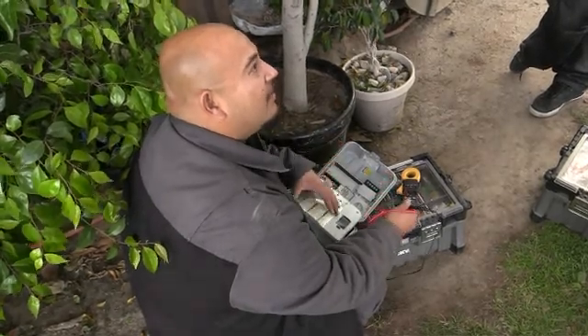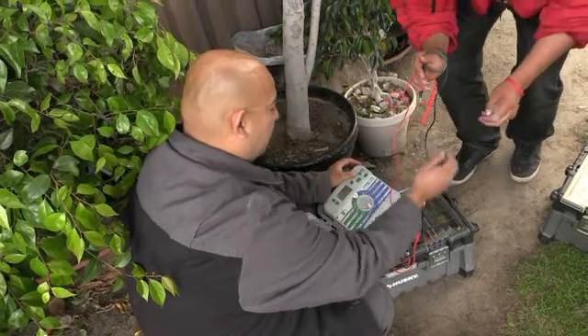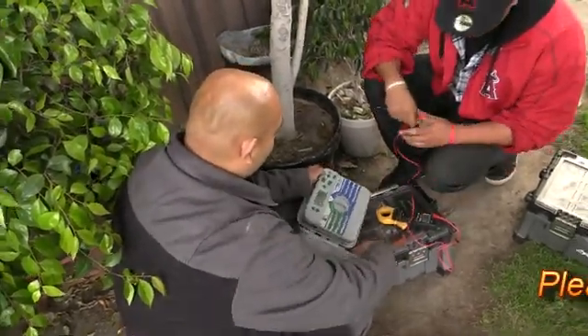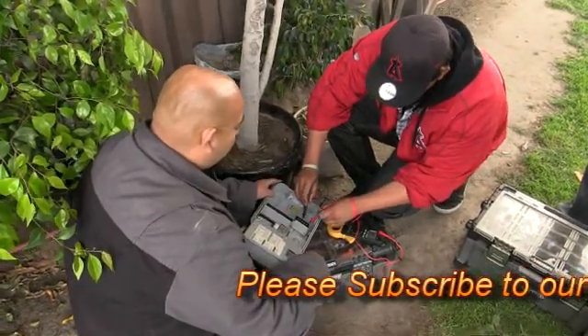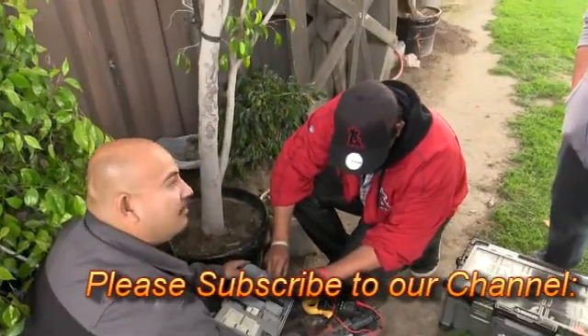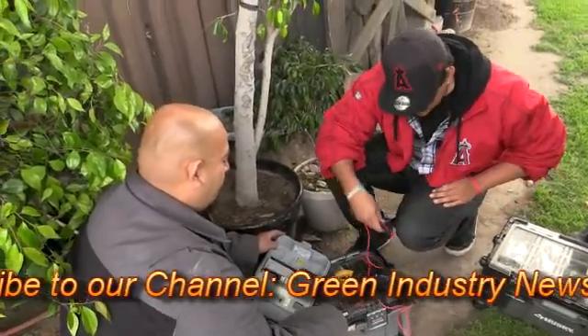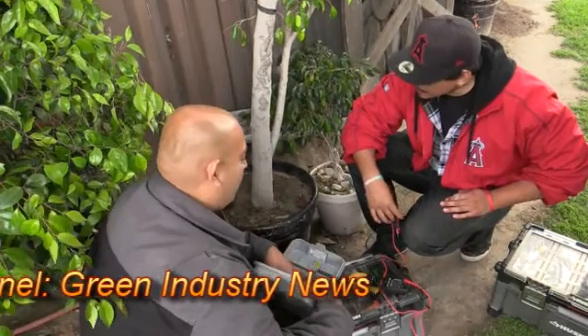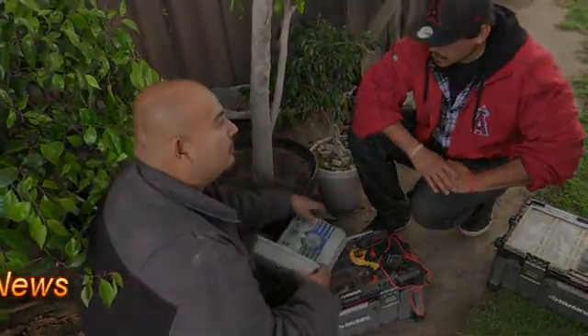So check your voltage like that. Make sure you're on voltage AC when you're working on the timer. Right now we've got station 1 on — touch one probe to common and one to terminal 1 and you'll see the power. Now that we know that's good, we'll jump back onto this timer and go through each station and terminal.